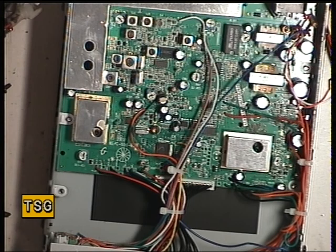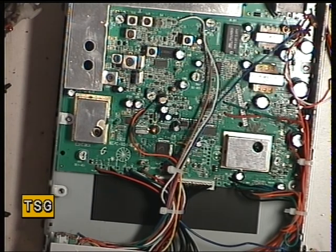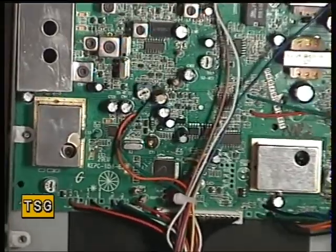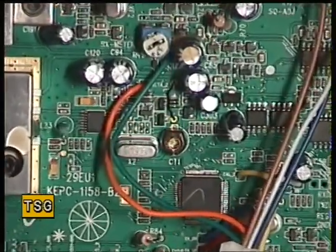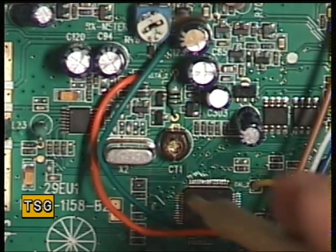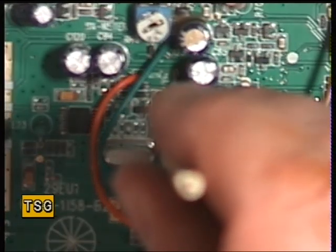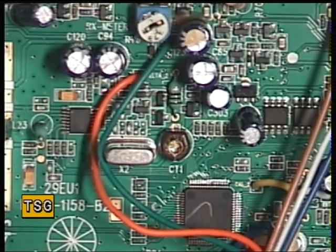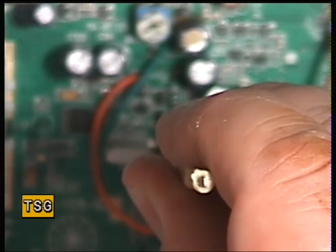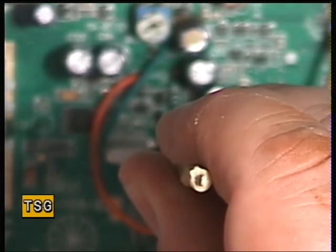I'm going to set the transmit frequency. I'll do a short video of this because I haven't actually proved that any of these coils are the right ones. RV1, TC1 — and we'll just zoom in on that. Okay, I've got TC1. It's the reference oscillator's frequency trimmer. It's just slightly off frequency — slightly low: 27.79121, which would be 27.79125. Just pull that up — that's absolutely fine.